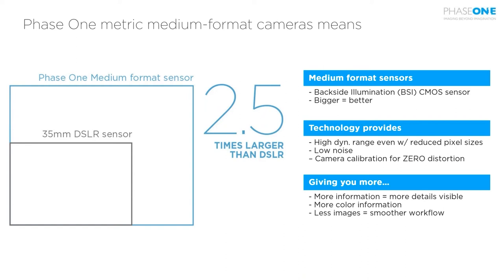You directly see that in lower noise — the sensor is more sensitive with less noise in shadows. We have a very large dynamic range: more than 83 dB, which is 15 f-stops. In post-processing you can open shadows, bring down highlights, and balance high-contrast images so there are no blown-out areas and no overly dark shadows — a lot of detail, which brings better results and better measurements.